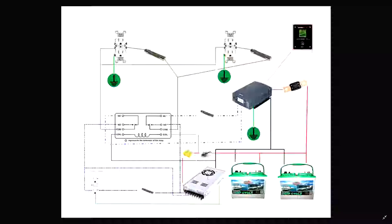So essentially, as long as the power is active, this relay will be closed to normally open, which means that as long as there is power going to the relay, the magnet will stay active and it'll keep the normally open contacts closed. As long as there's AC power coming into the unit, into the house, that power will go out through the common on here, out to the devices, to the two receptacles here, okay?